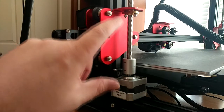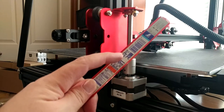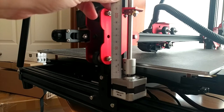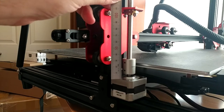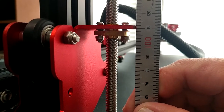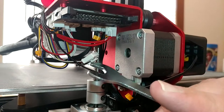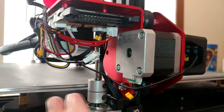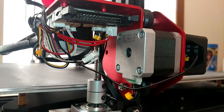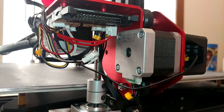Very nearly forgot — I need to check my height on both sides to make sure that when I adjusted these nuts I didn't put the gantry at a weird angle. Got my metric ruler — straight out of Japan, long story — and I'm just going to eyeball it. My eyeball says that is like 108 or 109 millimeters from the top of the stepper to the bottom of this bracket. I'll get the other side adjusted so it's about the same and then try to print. That's easier said than done because of all this stuff in the way. I'm going to take this wrench the printer came with — which is 2mm thick — throw it on top of the stepper and put my ruler out here. When I do that it's saying this side is about two millimeters low. So I'm actually going to drop the other side two millimeters to balance it.